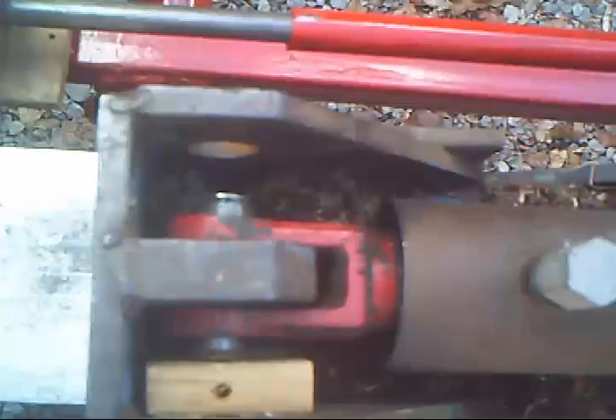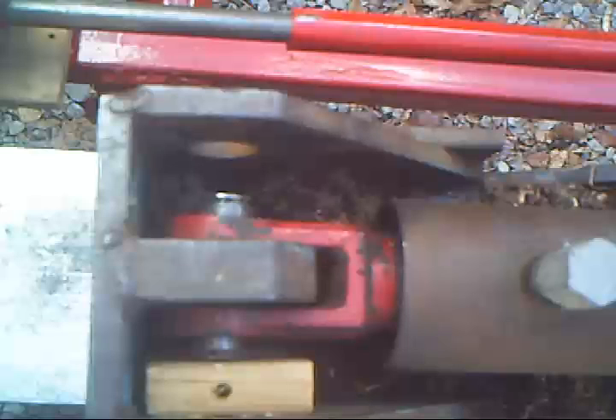The splitting ram is connected to the cylinder yoke by a one inch steel pin, and a one and one quarter inch pin access hole on the ram assembly provides a method to connect the plunger arm to the ram and cylinder pin. The wooden block holds the pin proud of the lift deck side. The one inch pipe T head of the plunger arm is inserted into the access hole and over the yoke pin.